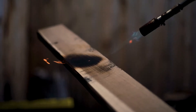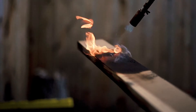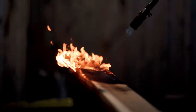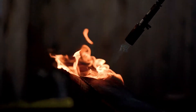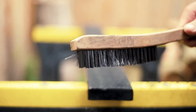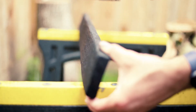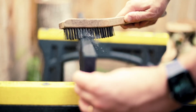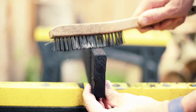I wanted to create a little upstand because most of the table is functional but not that interesting. So I used the shou sugi ban technique, where you basically burn a piece of wood — using a blowtorch to create what's called an alligator char on the top surface — then use a wire brush to clean off any excess char. Once done, you're left with something that looks like stained wood but has extra texture and depth, and it's protected from wet without needing any additional varnish.